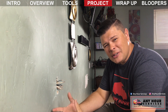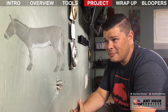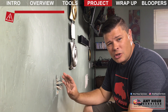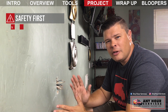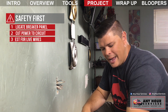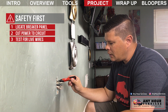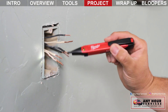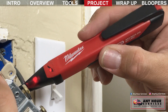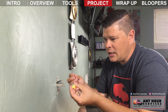Safety first — even if the wires are already out of the wall and there's no device, don't assume anything. Make sure that the outlet or switch you're working with has the power shut off. Go to your breaker panel, turn off the circuit, and use your tester to confirm that all of the wires are dead. If there's still power, your tester should light up or make some noise.